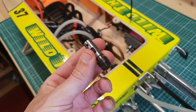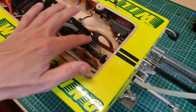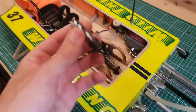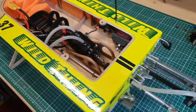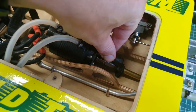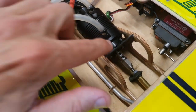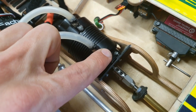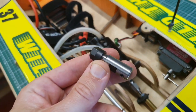What I'll do is spin up the motor with the original coupler, record it, then install the new coupler and record again to listen for any difference in sound. The only issue is this coupler doesn't fit — it's too long. So I'll install a spacer behind the motor, between the motor brackets and the motor, shifting the motor backwards about five millimeters so the coupler fits.